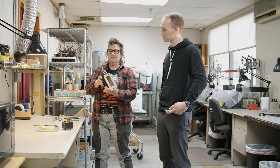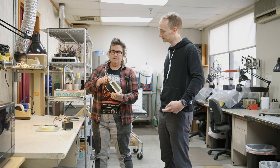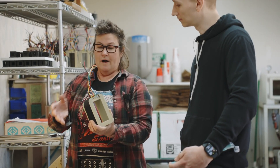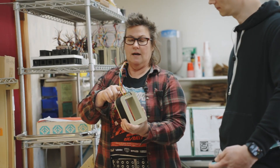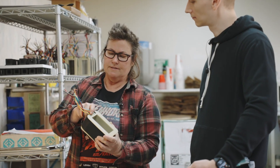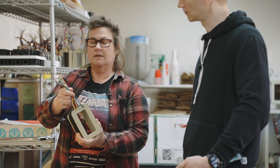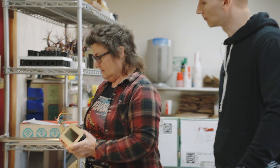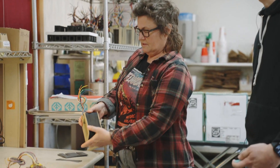Let's look at what happens after we've got the bobbin all wound, because we can't make anything transform quite yet without the laminations. Here's a big transformer. Once we've got this, they've taken the layers and combined them in serial and in parallel — the different windings combined inside — and brought them out on these wire leads. They've terminated the magnet wire inside and brought them out on conventional wire leads, because that's how we're going to load this into the chassis. They've wrapped up the bobbin real pretty with this cloth tape.